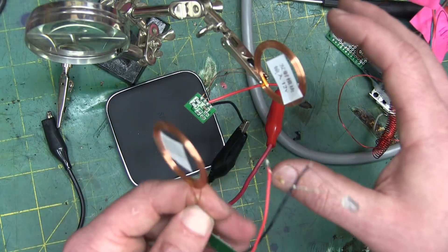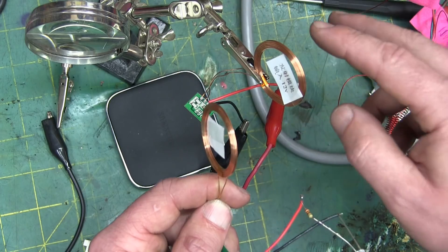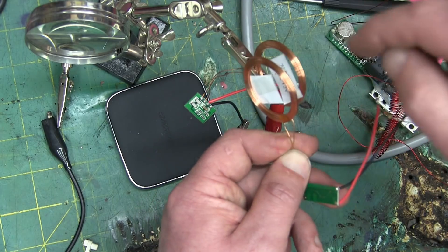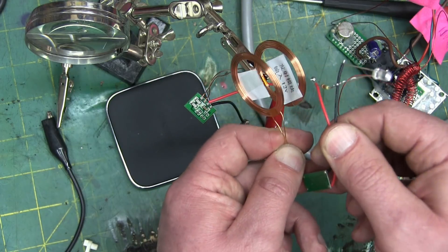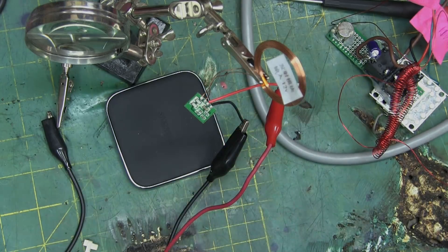It's so fucking simple. All that's happening — my battery pack is dying — but all that's happening is we're turning on and off the electricity, and the magnetic field is expanding and contracting. We put another coil close by, it's picking up on that expanding and contracting field, it induces a voltage in the coil, and we see the light is blinking. That's blinking lights — and thanks for watching. Keep your dick in a vice.